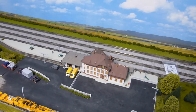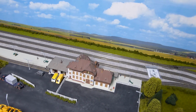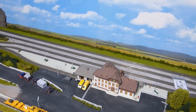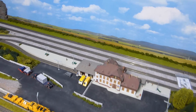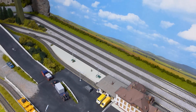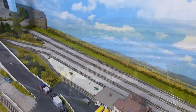So that's my plan. What you've got to do when you're putting automated feedbacks in is you've got to start with either the left or right hand rail, and then you've got to use the same rail on the rest of the inputs on the detector unit. So it's either, you know, negative or positive. You've got to bear that in mind, and you can't swap around halfway through. You've got to remember which rail you're going to connect from where you started off on your first detector.